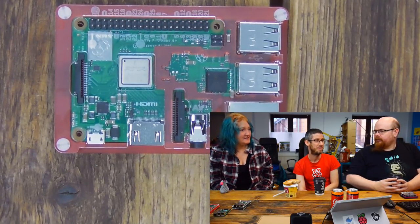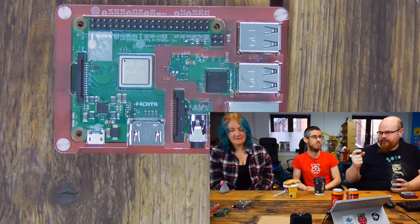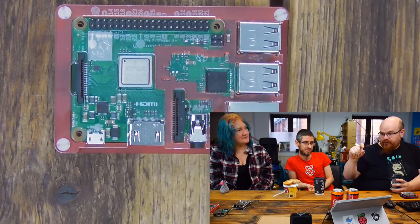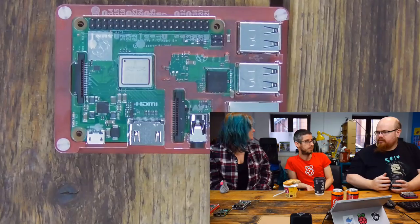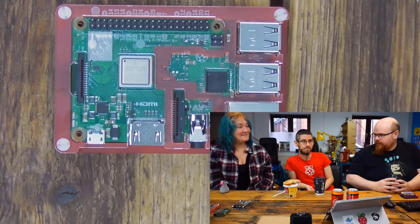But yeah, with the PoE pins, the Foundation have said if your HAT has the 10 millimeters clearance, then it will clear those pins. Yeah, that's in spec. Our boards, we do allow them to go closer if you want a slimmer Pi, but it's fine with everything. It does get close, but the Rainbow HAT's the one we've seen where those standoffs are needed. I think we supply them anyway, so that's all okay.